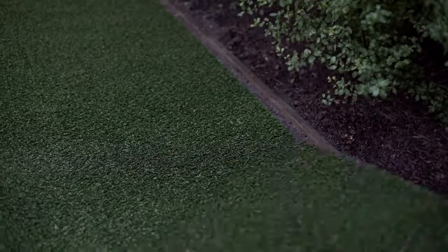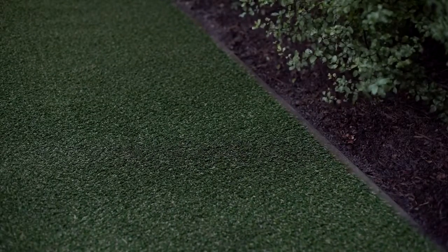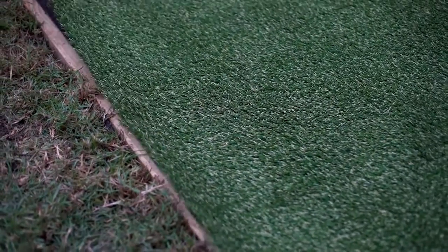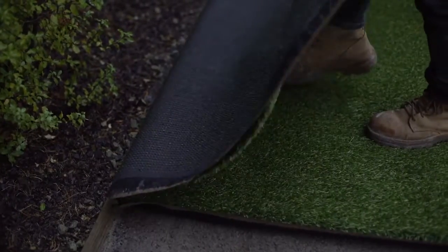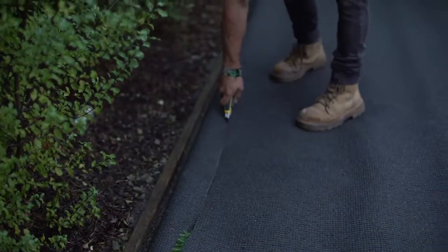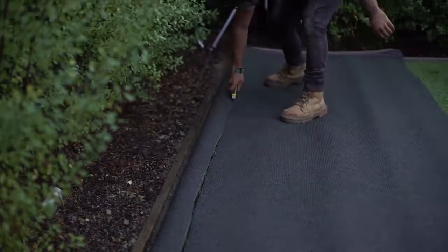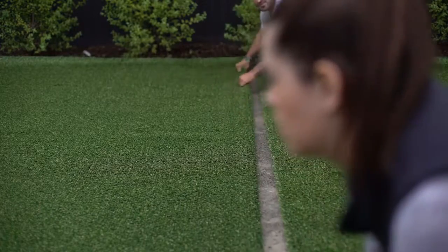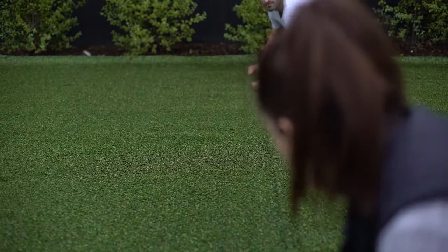Place your grass into the desired position. In most cases you can butt your grass in sideways against your edge and cut both ends to the required length. To cut your grass, fold it back so that it exposes the backing and that it is in line with your finished edge. Use a sharp knife and cut the grass from the backing along the entire length.